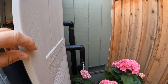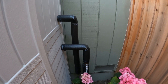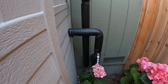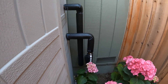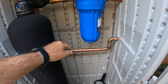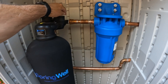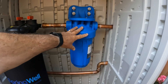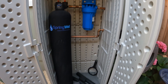Over on the side here you can see where the water lines come out of the side of the house. There's a shutoff valve to turn off the main water line on the supply, which comes into the shed. The supply comes in on this lower line to the tank, and then comes out of the tank back through the filter.